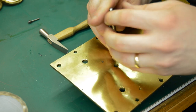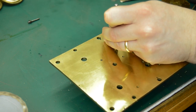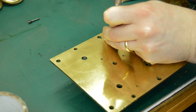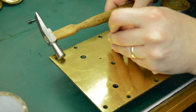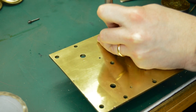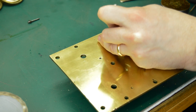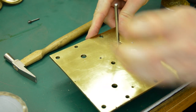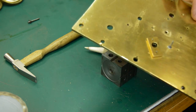Obviously there's a lot more bushing required on the smaller bushings higher up the train, but I thought I would just use this video to focus on the larger and more involved bits of bushing work. Almost every bush in this clock — in fact I think it was every single bush — had to be reworked. So it was quite a lot of work just on the bushing and depthing front.